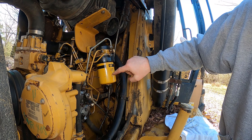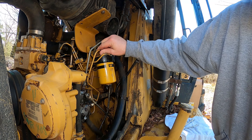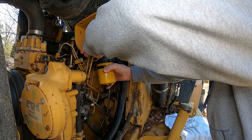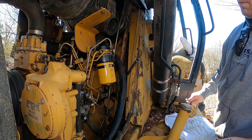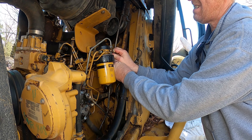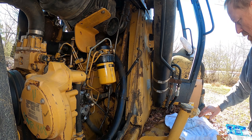The fuel line comes into this, goes through this fuel and water separator, and then to the cylinders in the engine. Usually I tell people if you're going to replace something and a part wears out, go ahead and buy two — but on this one I don't say that because this piece is a hundred dollars, so you might not want to buy two. And these lines, you don't want to bend those too much because if you break one you'll probably have to order another one, which will set your project back a week at least.